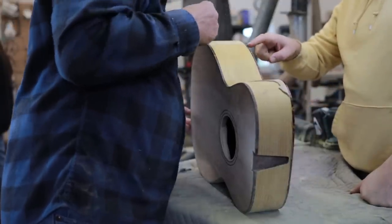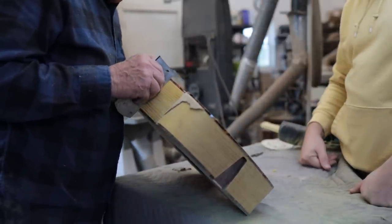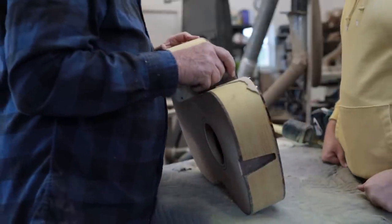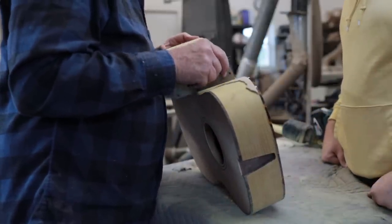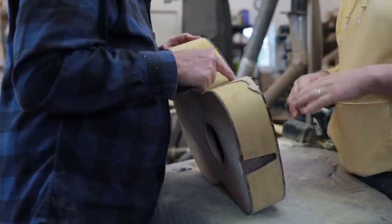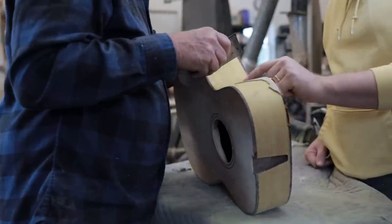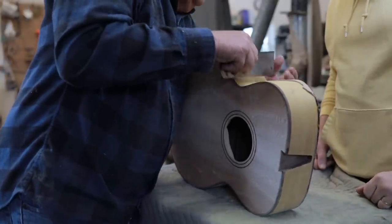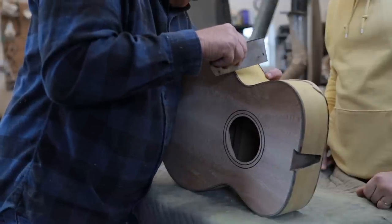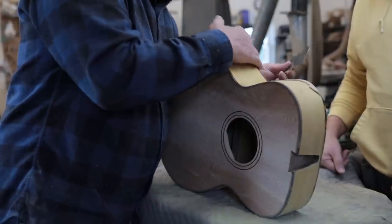Is the point to get the sides all the way clean? Like, I'm undoing the sand marks that I made. At this point, I wouldn't really worry about getting the sanding marks out. Instead, concentrate on the flatness here — getting it to a place where you won't even feel it, where you wouldn't know there was a joint there. Yeah. It came up about halfway, which means it'll need a little more later. But I would just round it a little bit — I don't like it so sharp. It feels like a razor.